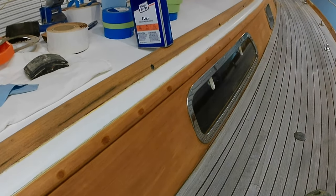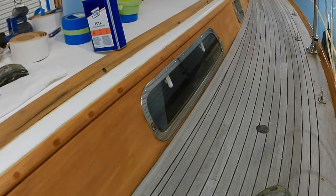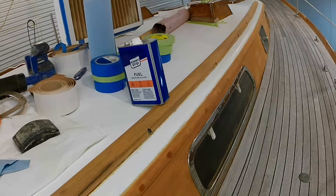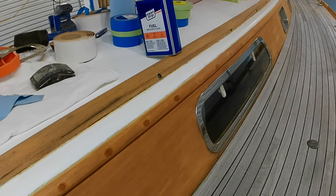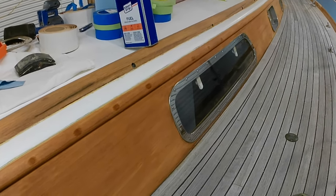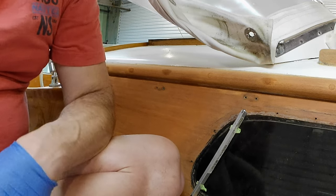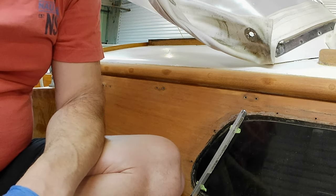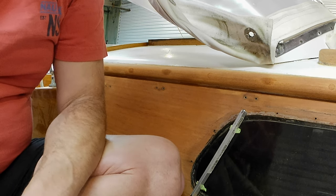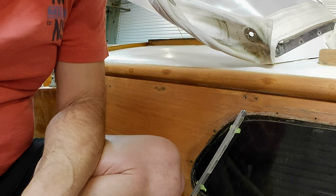Okay, here we are again — we're about to mask the boat for the varnish. I have the masking tape and some denatured alcohol, which I'm going to use to wipe down the wood before I mask it and get all the dust and dirt off before putting the varnish on. Welcome back. I'm about to start wiping down the coach roof and the grab rail to prepare it for varnish. I'll wipe down all the wood with denatured alcohol probably at least twice, and clean the area surrounding it as well because I need to put tape down and want all surfaces the tape sticks to to be clean.